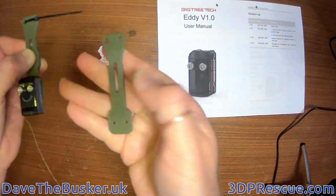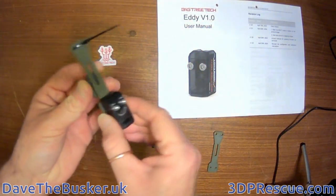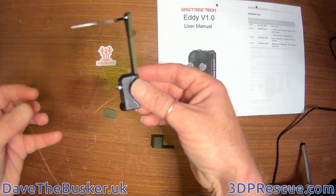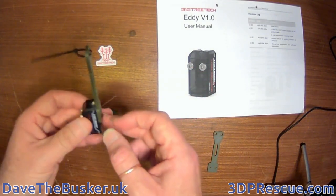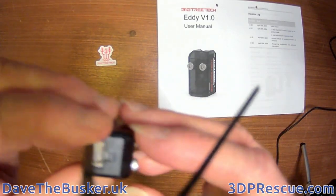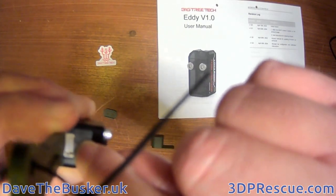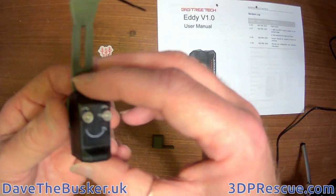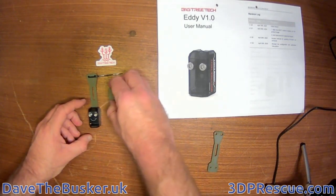It's just a simple slider design, nothing much to it. One of the things I found with the instructions is when it's talking about the boot button, it shows an exploded picture. The first thing I did was grab a spudger and tried to open the shell for eddy, when I quickly realized that didn't make sense. The boot button is just here - you press that down with something as you connect your USB and that puts it into flash mode. Don't try to prise the case open like I did.